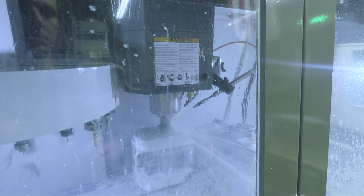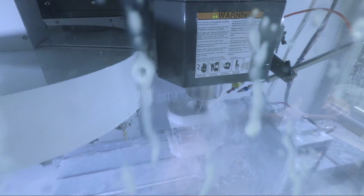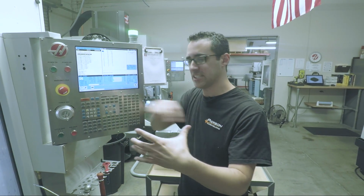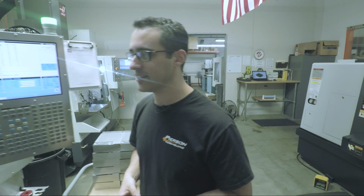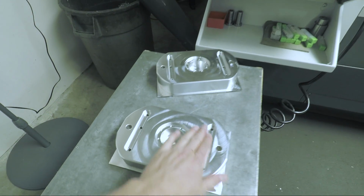Finish pass. Yeah, finish pass. I played around trying to get a decorative look instead of the standard back and forth. So it's doing an adaptive, which outputs a spiral. Sure. And I had to model up a sketch. Yep. So it followed that because there was nothing that would put a nice spiral finish. You could do a trace toolpath. Yeah, if you drew a spiral. Sure, it's a good idea. Use the golden ratio. There you go. Did a video on that. I like that, expanding manner. Fibonacci. Yeah, that does look cool. I love those little touches.